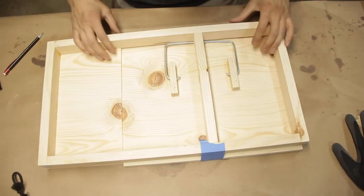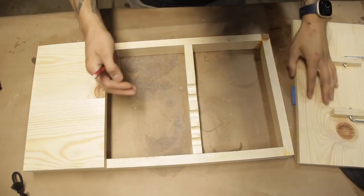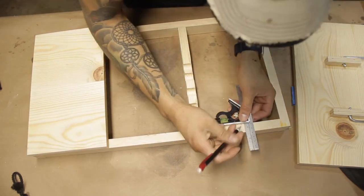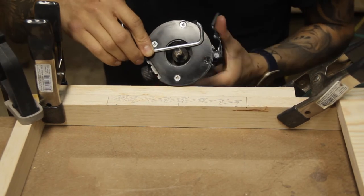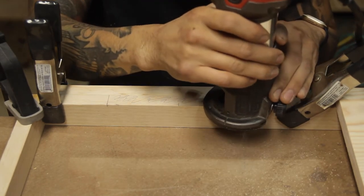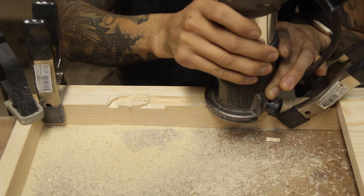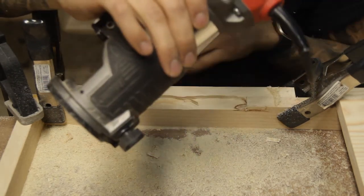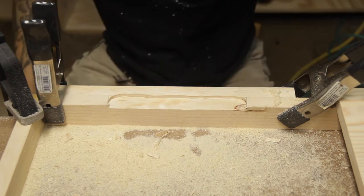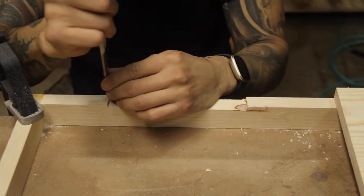We still need to mortise out a chunk on the skirt so that this bar sits nice and flush. I'm making a mark on the outside of the bars on the skirt so I know exactly where to cut. To do this, I'm using a small trim router with a backer board to give the router more surface to lay on — that'll also prevent more chip-out on the backside. You can do this by hand, it'll just take longer. Get the depth of the rod itself and go slightly above that with your bit so everything sits nice and flush. Once you hog out most of the material with the router, I'll come back with a chisel to get right up to my line and get everything nice and square.